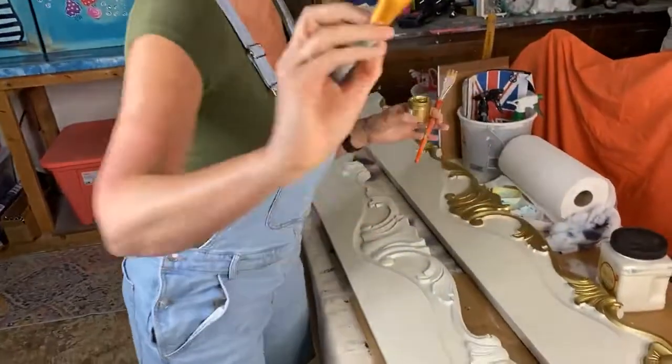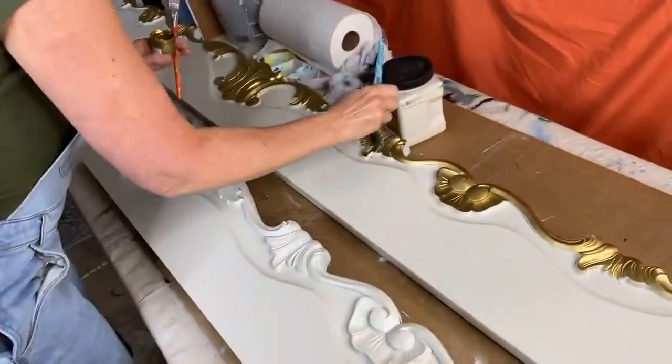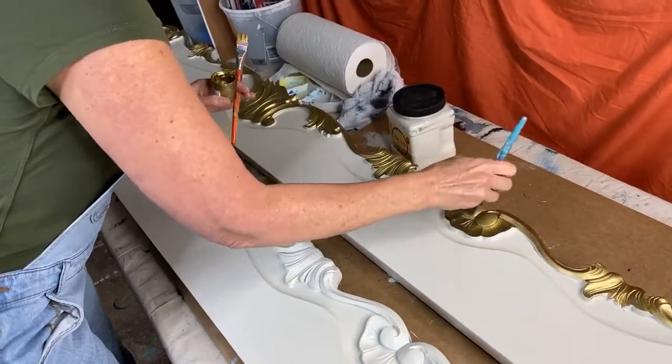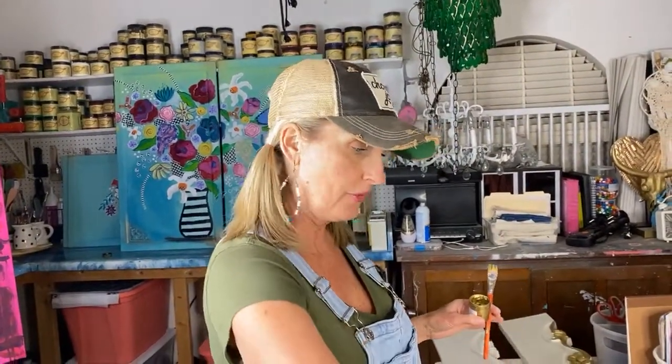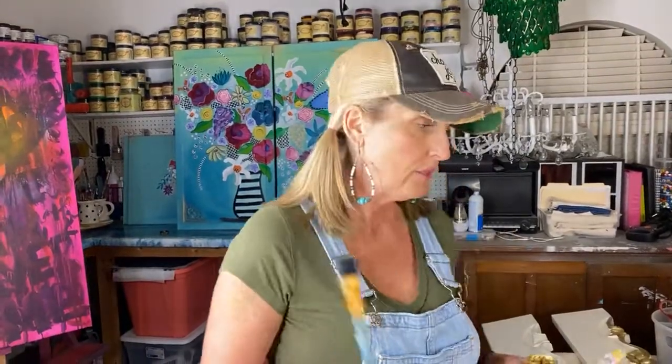What I'm going to recommend is after you've painted your piece and you've got your gold in place and let it set for about an hour, go back with a dry brush over the area and just rub it - you're not going to mess it up, just rub it and wipe off the excess on paper. This has been on here maybe 20 to 30 minutes - that's all I'm getting off. I'm rubbing it and you can barely see it on my brush. It's dry to the touch in an hour, but it isn't cured. If I put a water-based top coat on there, it's going to reactivate and smear onto my drop cloth color. Wait a good four days, or don't top coat it at all and just be careful with it through the typical 30-day care time - everything requires 30 days care time.